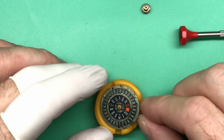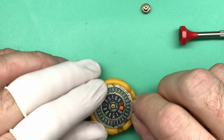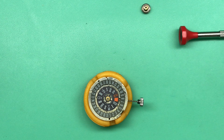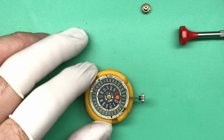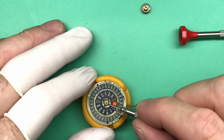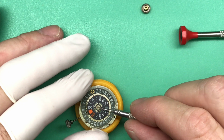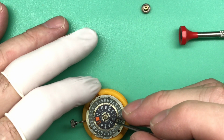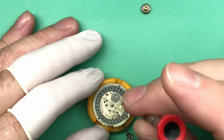Alright, so now we can move to the calendar and the components that make up the one set of components, there's like eight different pieces, that operate the hour recording wheel on your chronograph, and they're under a secondary plate. So Seiko was able to sort of get a whole bunch of things installed so you could add one more register for your chronograph. But it's a crazy group of things. So all these extended levers and parts and pieces. Roman English day wheel, day disc, I should say.